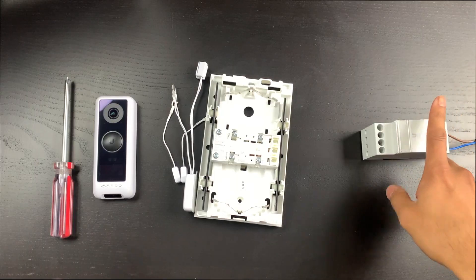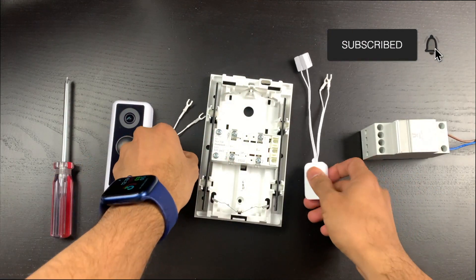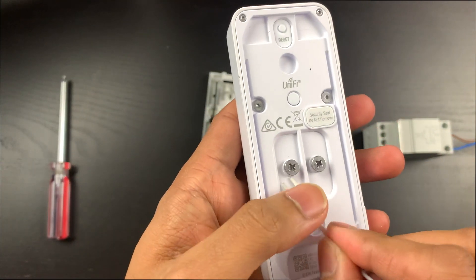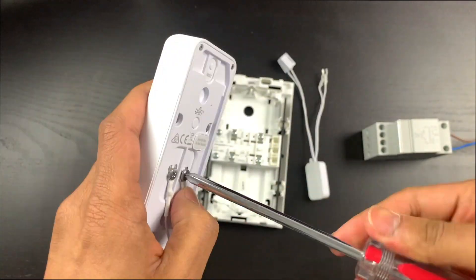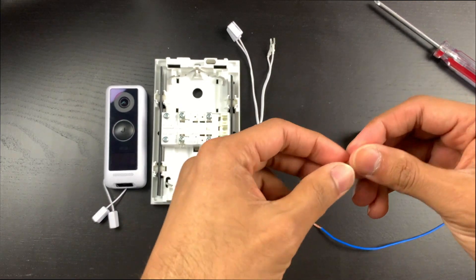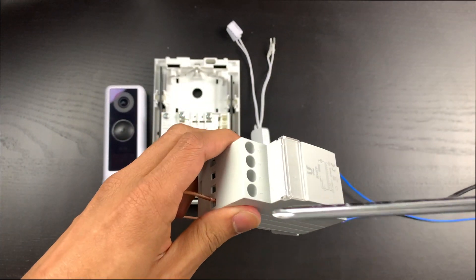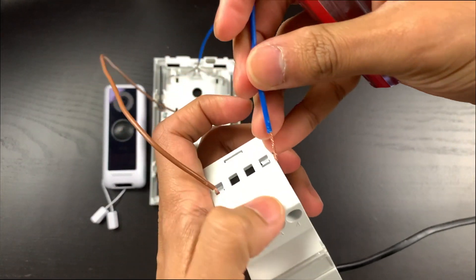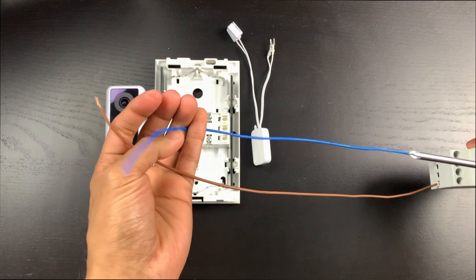My cabling standards and color coding aren't conforming to any specific standards, so if you're attempting this please check your local guidelines. At the back of the unit there are two connectors — one that connects to the chime and one that connects to the back of the doorbell. I'll show you these: this one goes in here like this, then I screw it in and do the same with the other one. There's a little hole at the end to connect the cable in by pressing it down.